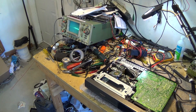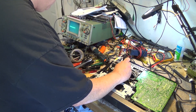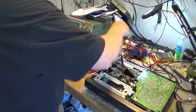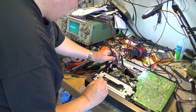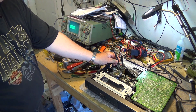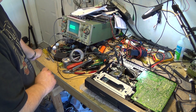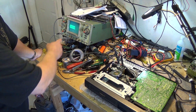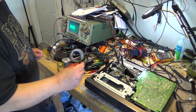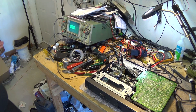Without using a scope you're never going to get it a hundred percent perfect, but that was done without a scope. Let's just reconnect the scope — as you can see my scope was not connected — and we'll see how close I got just by eyeballing it with the monitor. It's not going to be exact, but as you can see it's pretty damn close to being bang on. My exit guide is perfectly flat. My entry side guide I'm off just a smidge — but now it's perfect. There you go.